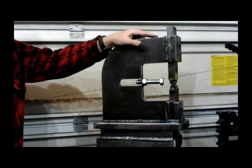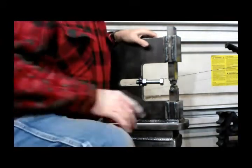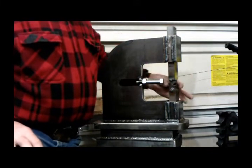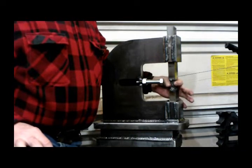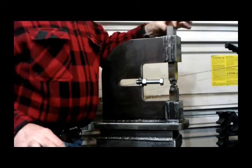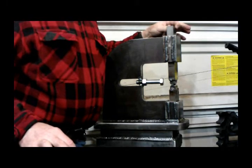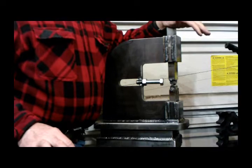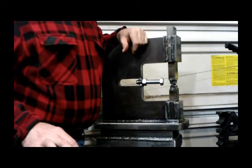We're going to do a time study, I guess you could call it. These dies are one inch by three inch, and I just welded two pieces of three-quarter inch round 4140 down here, so you've got 4140 dies hitting 1018 cold roll steel. The top will possibly ding up unless you weld another three-quarter inch round 4140 on top — someone suggested doing that because you could just cut it off and put a new one on.